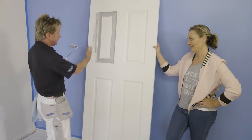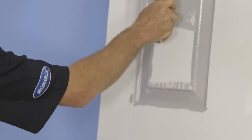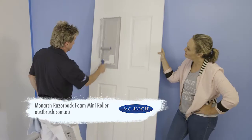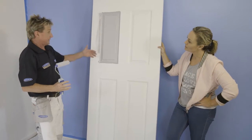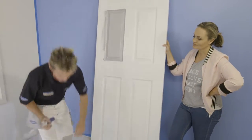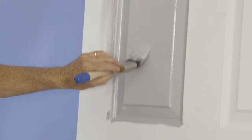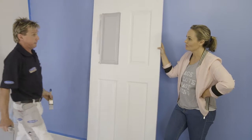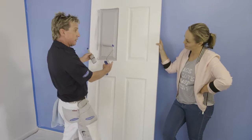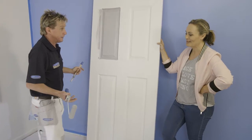Now we've cut in with our brush, we're going to use these fantastic mini rollers to do the door panel. They're so small they fit each section perfectly. This foam roller is perfect for both water-based and oil-based enamel. What a painter actually does — rather than leaving it as is — is take the brush used for the molding and do what's called tipping off, going very lightly with the tip of the brush. This removes any stipple or bubble effect the roller leaves behind. Then we do all four panels the same way, one piece at a time.